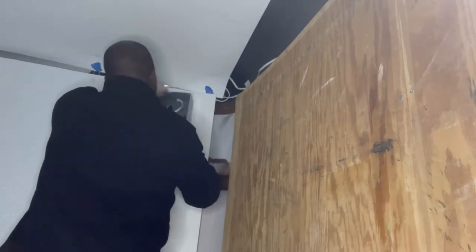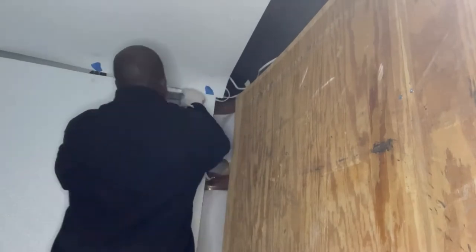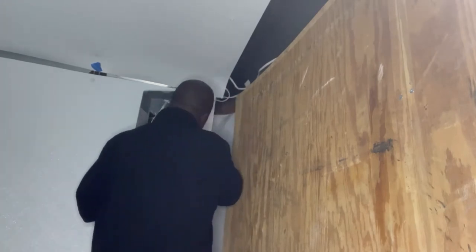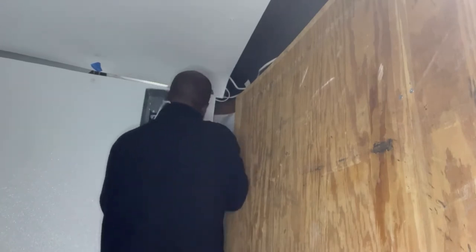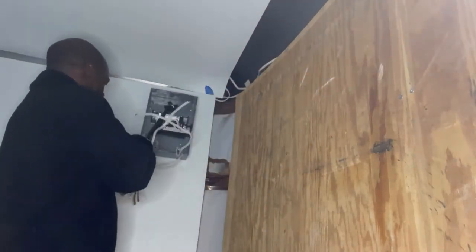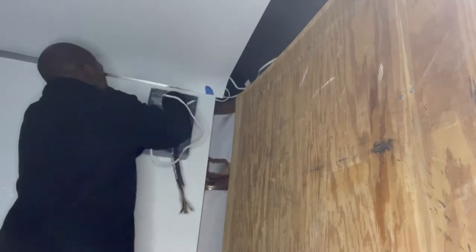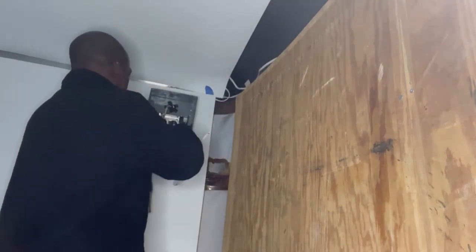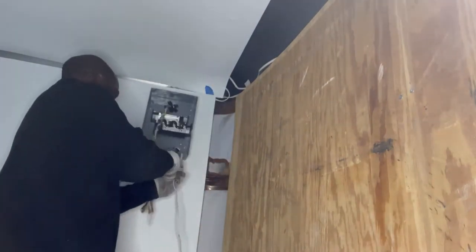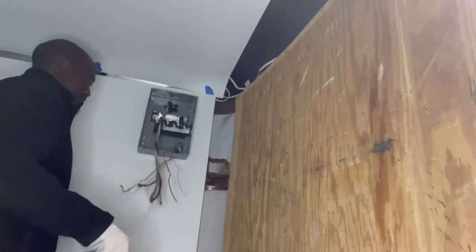Here I'm running to the service box where I tied in the two home runs. I have two home runs going in there and I'm using 2x15 amp breakers for those. That should be enough — everything in here is essentially LED. The lights are going to be LED, I have an outside light, everything LED, so you're looking at maybe six watts or two watts per fixture. I can also show you the sheet on how to calculate all of that.